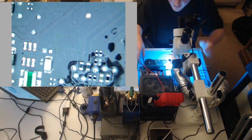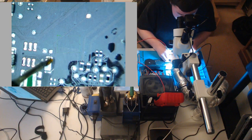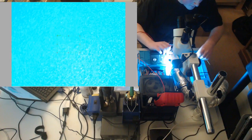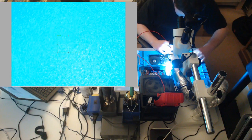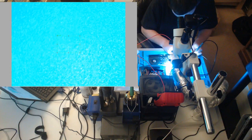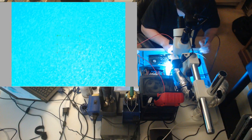Let's measure what our PP Bus G3 hot is. And it is 0 volts, so something just happened. Getting nothing on ACN probably. Let's see. Sometimes the MagSafe adapters, the wires can be a little frayed, but I don't think that's the case in here. Okay, so what's going on right now is something happened and the ISL said, nope, do not let that charger come on. So if we were to measure on ACN, I'm pretty sure it's one of these pins when we first turn on.